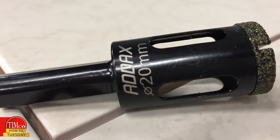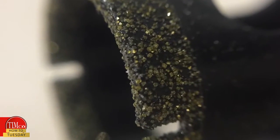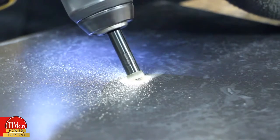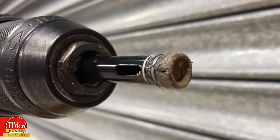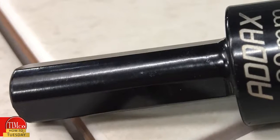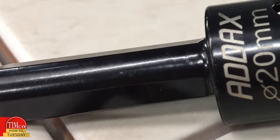The second type is our wet diamond drill bit, which has electroplated diamond particles for cutting through hard porcelain, glass and marble with ease. It should not be used with a corded power tool. It features a hollow body to facilitate cooling in larger diameters, with added cooling slots. The 20mm bit has an anti-slip shape.